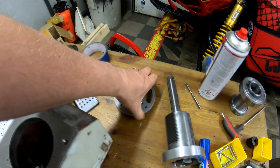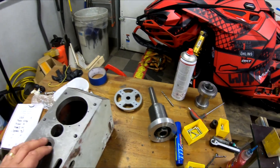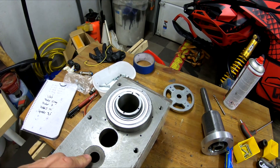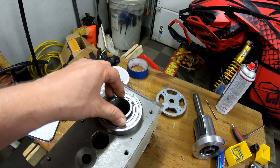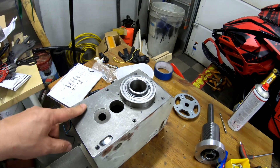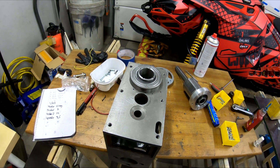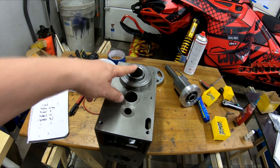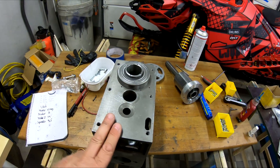This is the end cap for the new electric motor. The next step will be this part going here, and on top of this I want to make a pulley for the belt drive. The motor will be standing up here, so I will need a belt that drives this, and I haven't found any suitable size so I will be making them myself. I will start with that first and then see how big I can make it depending on the supporting bracket for the motor.